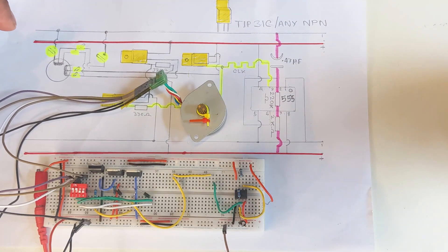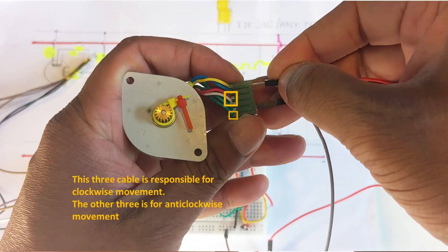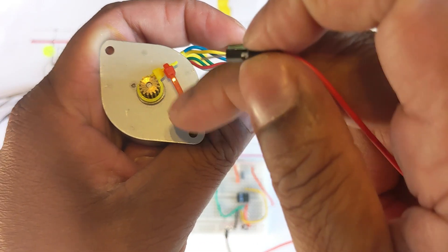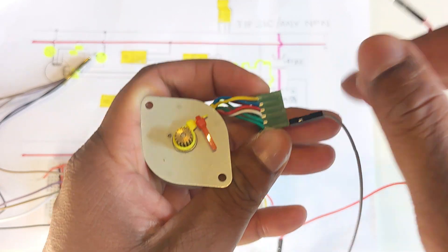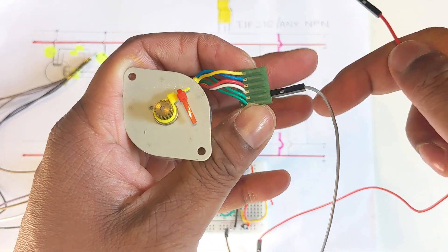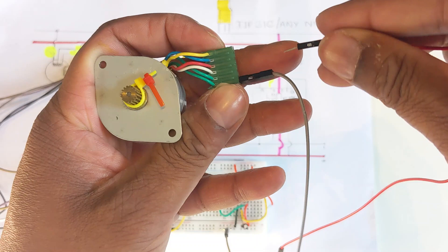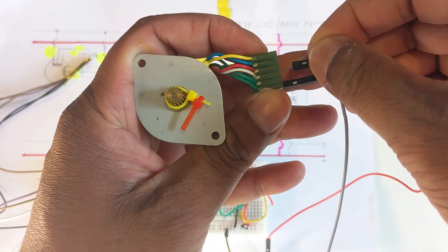Let's verify the coil configuration. I took off the jumper cable, and I'm connecting one of the grounds with the ground cable. I will inject 12 volt voltage with the first green cable and the white and red cables, but I need to turn them on in sequence. For the motor to move clockwise, the circuit needs to turn on the white and red cables one after another in sequence. For anti-clockwise movement, the second ground and the blue and yellow cables need to be turned on in sequence.